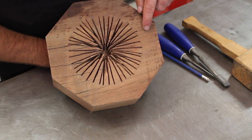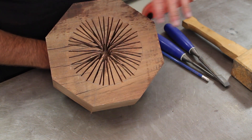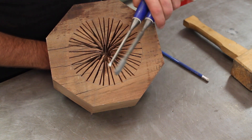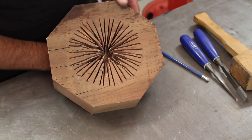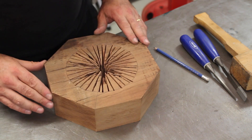I've finished all the cuts we want to do. They're not identical in every location but they'll blend out. The next step is to remove the majority of this waste — I'm going to use a carpenter's chisel to chisel it out, then use a flap wheel on an angle grinder to get the final smooth surface like you've seen in the other one. Let's knock out all this waste first.